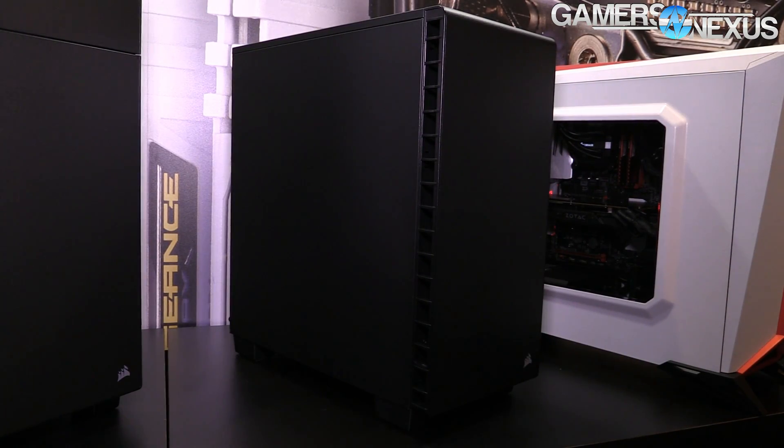That doesn't even count the plastic injection molds. If you look at something like a 600Q like this one, this side panel is a big flat sheet of steel that looks easy, but if you take it off you'll realize it's bent over itself a couple of times for structural integrity — with a lip so it fits in, and screw holes for thumbscrews. That's probably a two or three stage tool just for the side panel. Something more complex like a motherboard tray or rear fan mounts with PCIe slots might be a six or seven stage tool.